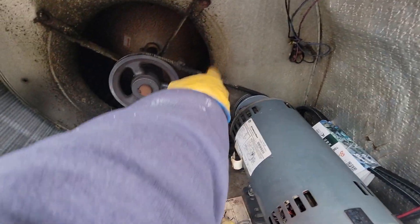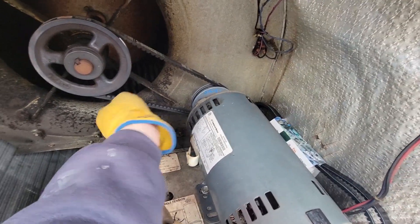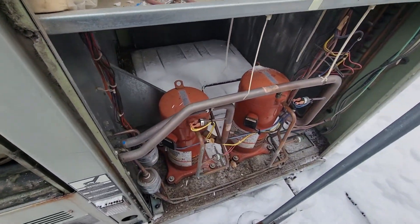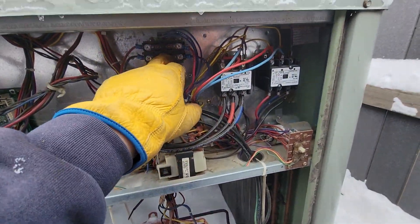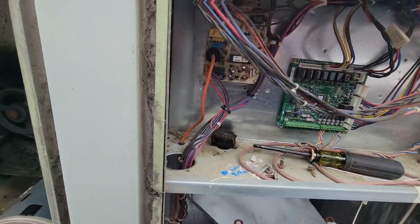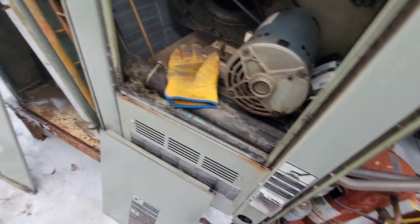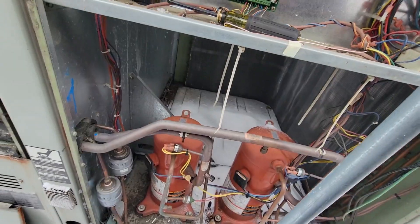I put a new sheave on back in August of 2021. We're out here for a no-heat call — let's see what we've got. You can barely see it, but there are two blinks on the diagnostic LED: one, two. On the back side of this two-blink system — that's system lockout. No kidding — that's Trane. Let's kill power and see if we can get her to start over again.